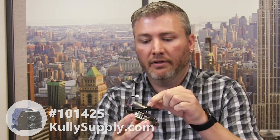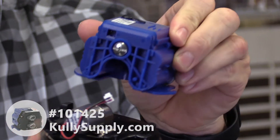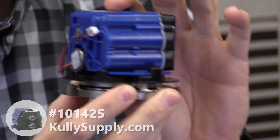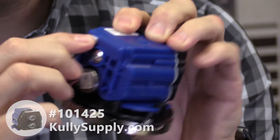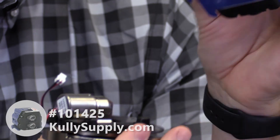This module sits on the inside cover — there's a metal inside cover and then this plastic cover piece. Put it on there straight. The module has a big notch on the back that fits right around the solenoid and sets in place. When you put the cover on with the screws, it will tighten everything in place. Set the module on there, and then the solenoid wire plugs right into the back — it only goes one way so you can't screw it up. To take it apart, just remove the solenoid wire, pop the module off, and change your batteries or replace your module if needed.